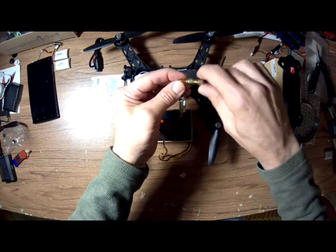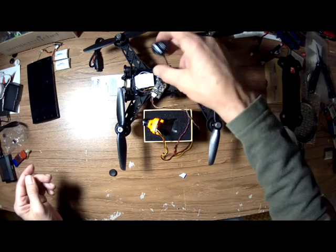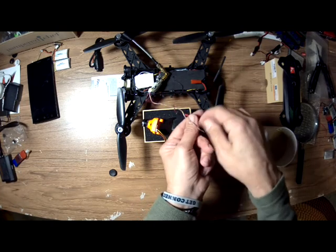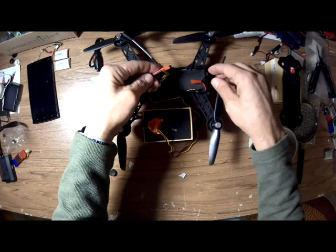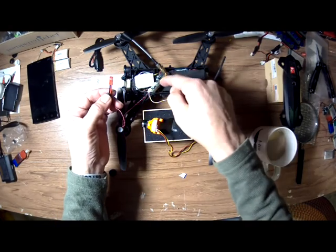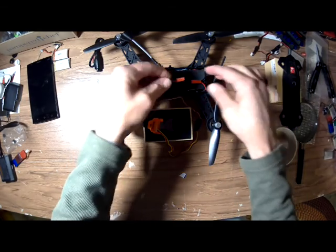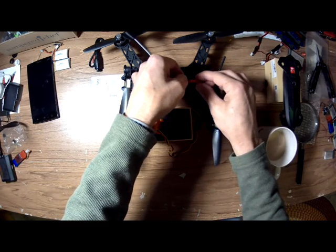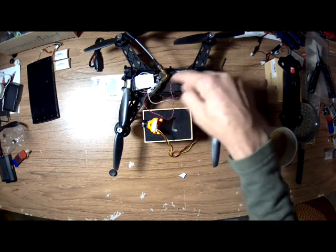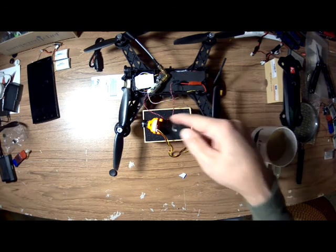It's been suggested that you don't ever power on your VTX or your Rx without having an antenna on, because it could burn them up. Now I have power coming directly off the battery into the VTX because it's wide voltage, so it doesn't really matter — the battery ain't gonna hurt it. So we've got power to the camera and to the VTX, and we've got five volts from the VTX coming out into the camera with video.